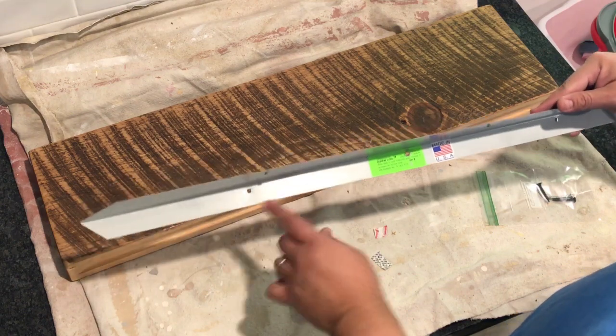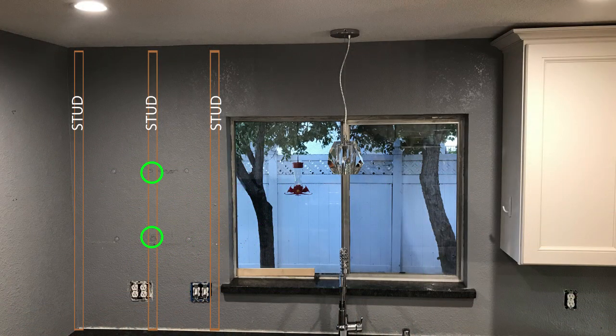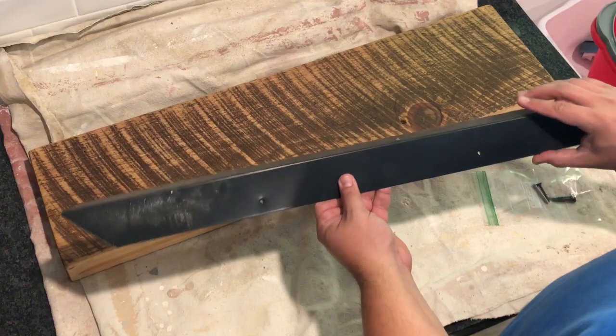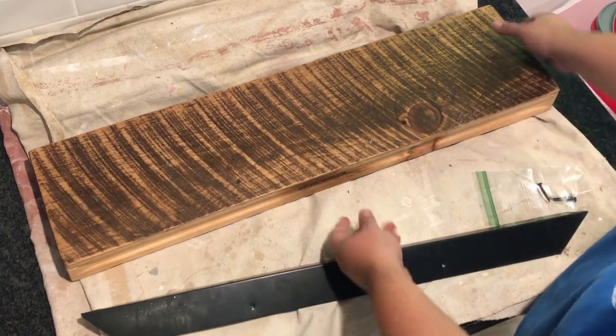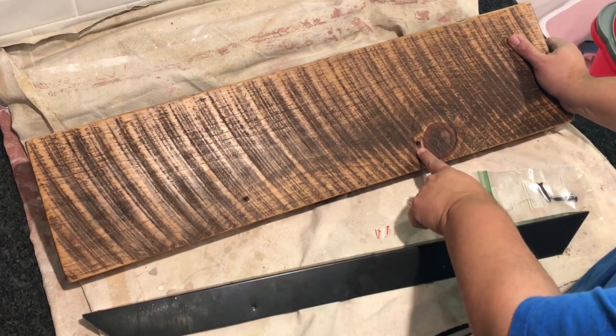You'll have to create three pilot holes. Take the measurement of that piece of metal and find the center so you can attach it to the main stud. The other two holes, equally spaced apart, will be for the anchors. You can see the bracket right there has two holes — those were made after I drilled into the two pre-made holes up top, and they just attach right to the metal.